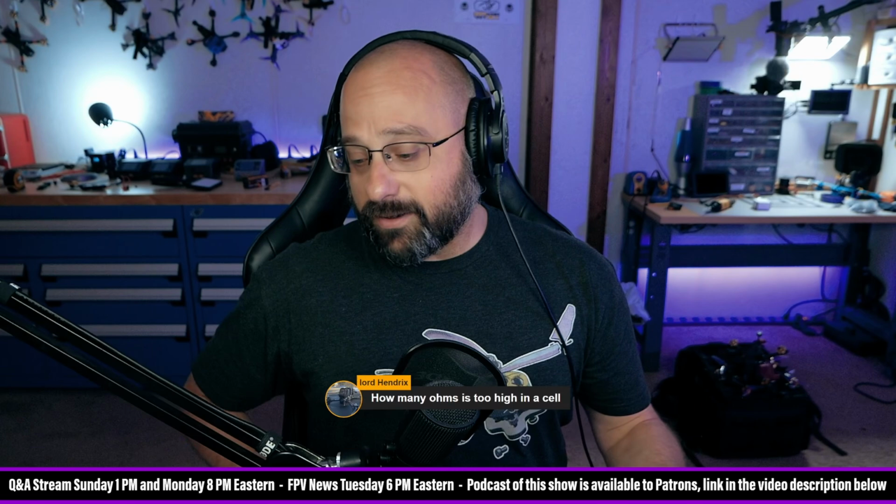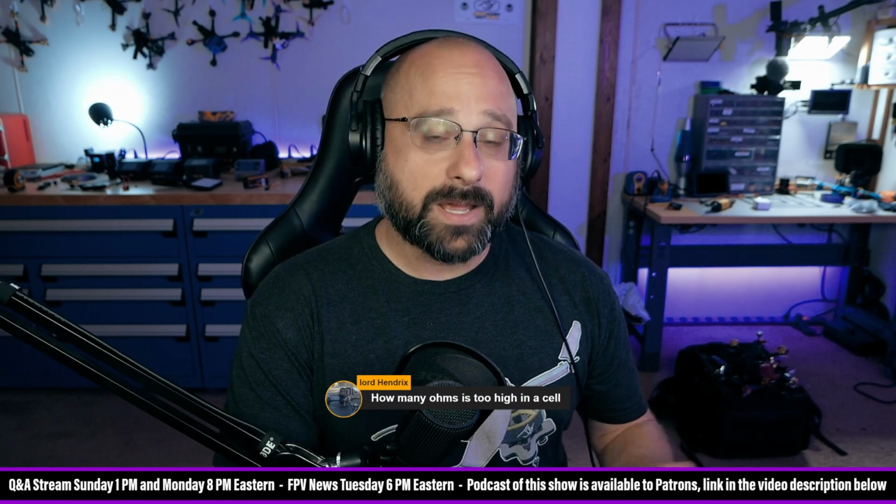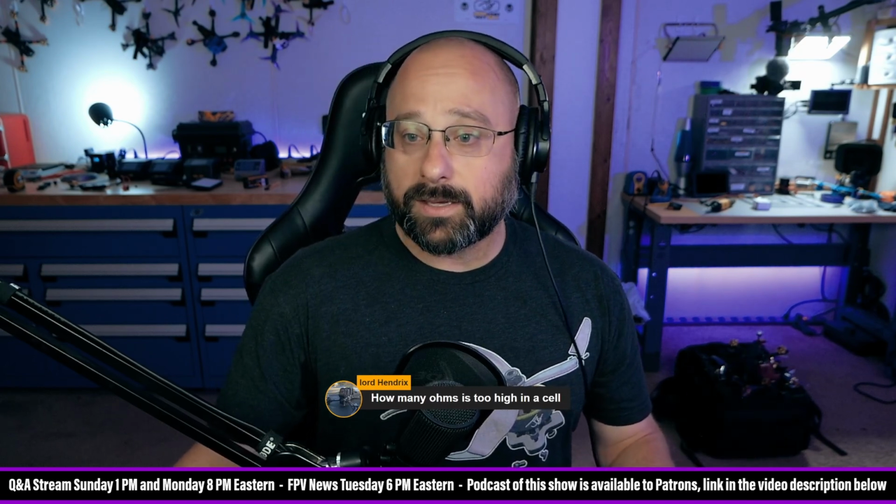Now, the way that I do this, I am fortunate enough to have air conditioning, right? So my house is usually about the same temperature, within a couple degrees. So if that works for you, then just bring your batteries in the house, let them sit for a couple hours, and then measure the internal resistance. But don't bring them in from a hot car and immediately measure the IR, because those numbers will not be valid.